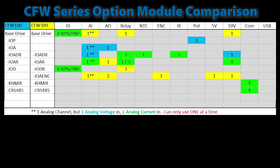This option comes with both the keypad and the RS-485 module that you need to talk to the keypad. Both drives also have a standalone RS-485 module. Only the CFW300 has an RS-232 module, and they both have a USB module which is handy for configuring and monitoring the drive with the free WPS software. But remember, on the CFW100 you have to remove the USB module if you want to plug in any other option modules, because there is only one option module slot on the CFW100.